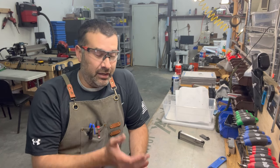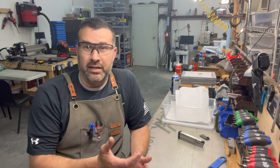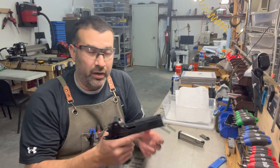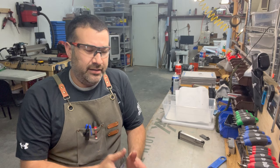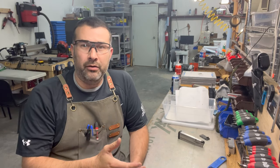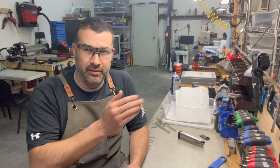The theory is you've got a mechanical machine here and metal's rubbing metal — anytime metal's rubbing metal you have friction, and the more times you cycle it the more it wears out. So yes, it does wear the gun out faster in theory. The other part is the gun slams harder when closing on an empty chamber, because stripping that top round out of the magazine and pushing it into the chamber slows down and cushions the slide as it comes forward. When you drop the slide on an empty chamber it doesn't slow down at all and it just slams home.